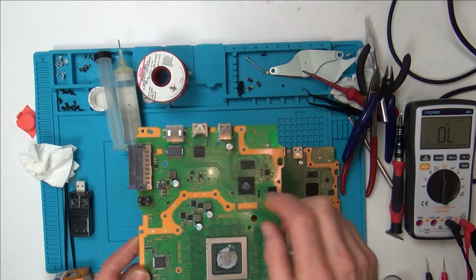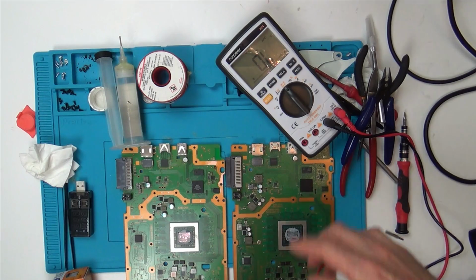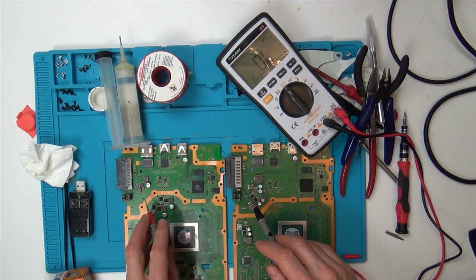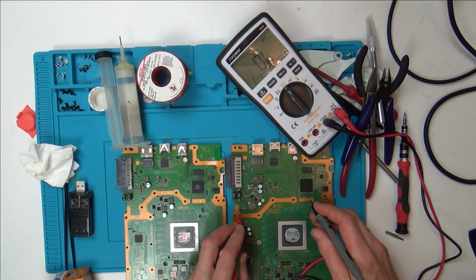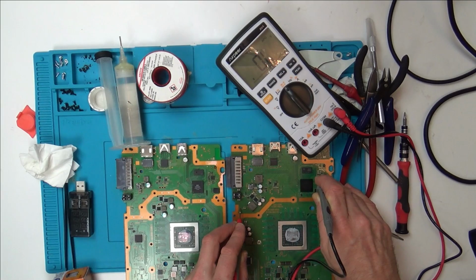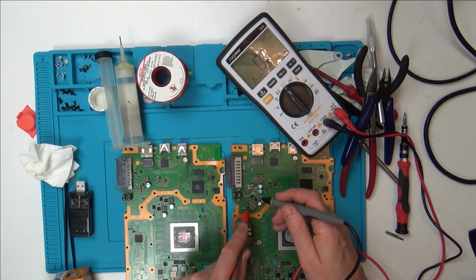Now, if we compare the two pads on diode mode, if it's a diode, it's testing different between them. I can't do it exact because the actual boards are slightly different, but I've been trying to work out what's what. For example, I've definitely got a short between here and pin 4 on this one here. Don't know where pin 4 is, hold on. Roughly around there, okay?